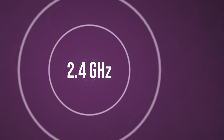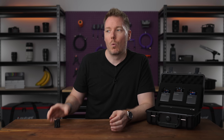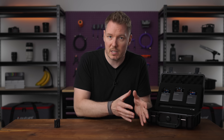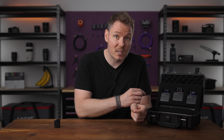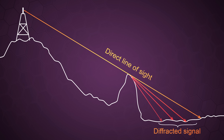But 2.4 gigahertz can suffer when it comes to signal integrity because it's more line-of-sight dependent. It can struggle to penetrate solid objects like thick walls, concrete, or even dense crowds of people, and it isn't very good at diffracting or bending around obstacles, making you much more likely to experience dropouts, static, or reduced range. When audio manufacturers designate a wireless system as UHF, they're generally referring to the lower frequency section of that range, usually from 500 to 1,000 megahertz. The UHF bands that the Saramonic K9 operates in, especially the 500 to 600 megahertz range, have longer wavelengths that give them a distinct advantage at penetrating obstacles like interior walls, furniture, and even people. They're also far more adept at diffracting or bending around larger obstacles, allowing them to potentially wrap around corners or minor obstructions to reach the receiver.